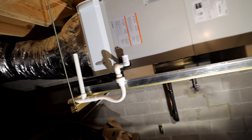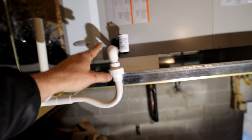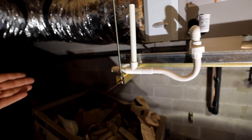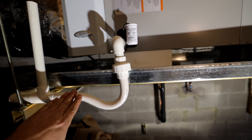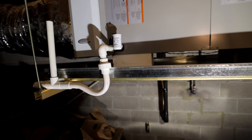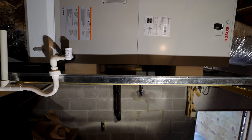For the drain line, this is the way I like to do my drains. We'll come off the primary of course. I like to put a union here so you can easily take that loose if you need to — so there's really no need to put a clean out on that side. And here's a vent just in case; the drain line is pretty short so it's not a big deal, but I put one on there just in case. I don't put a switch in the actual drain itself. I just put one here in the secondary. That way if the internal pan starts to fill up, that switch is going to cut it off and it shouldn't go anywhere else. We do have one down here in the pan as well — so just in case the pan fills up with water for whatever reason, it'll shut the system down as well.